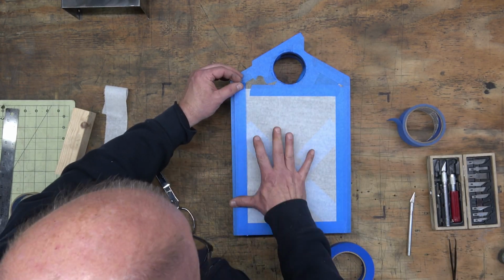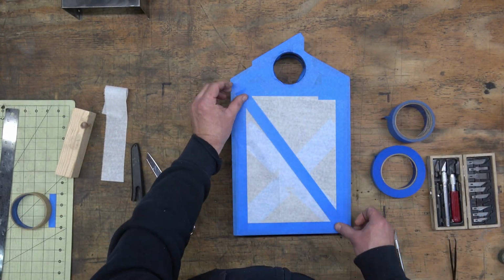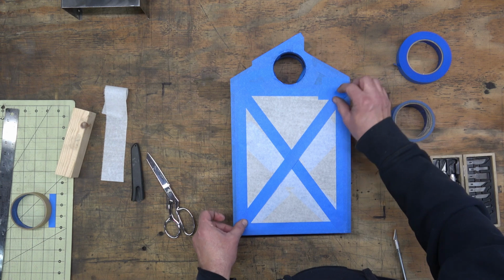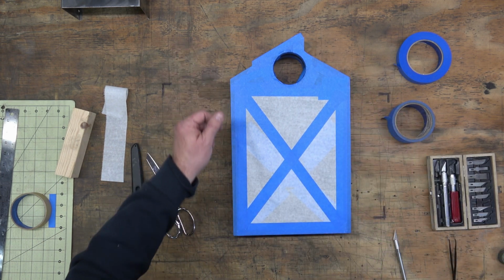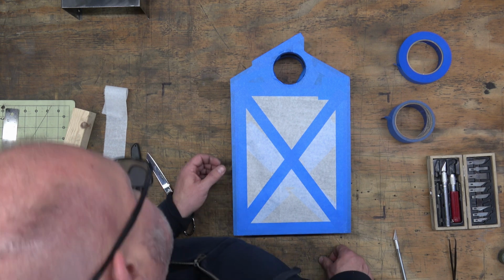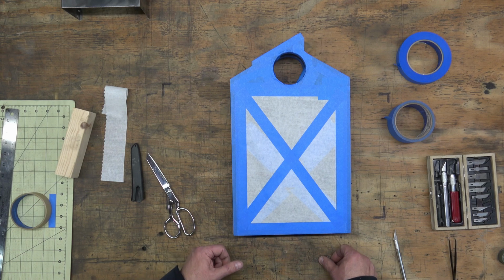And when we get done with painting the table, we'll come back and just run like a 220 grit orbital sander disc over that table surface to kind of refinish it and remove any paint that may bleed through.